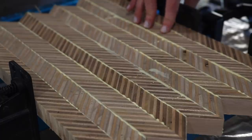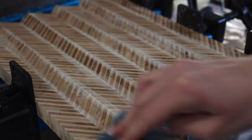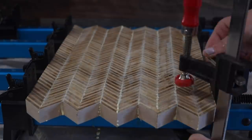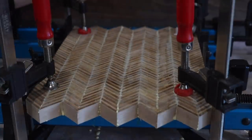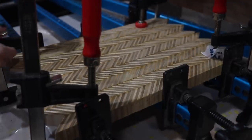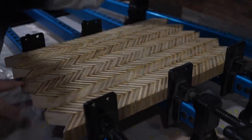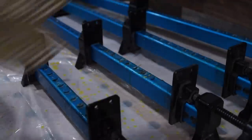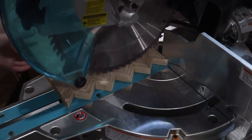It is really important to make sure that these patterns line up as closely as possible before gluing them up. Otherwise, if you want to use them for other patterns later, those patterns will not make sense — and unfortunately you are about to see that problem come to life in a couple of minutes. But for now, once that panel had dried overnight, I brought it to the planer the same exact way as the first panel and then brought it to the miter saw so I could cut one end completely square before bringing it over to the table saw.